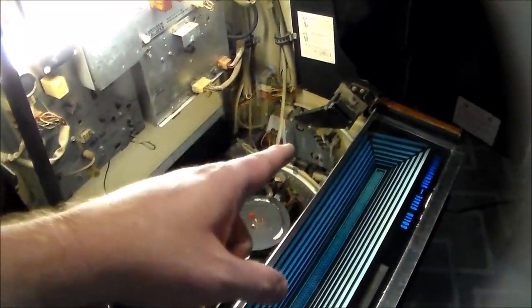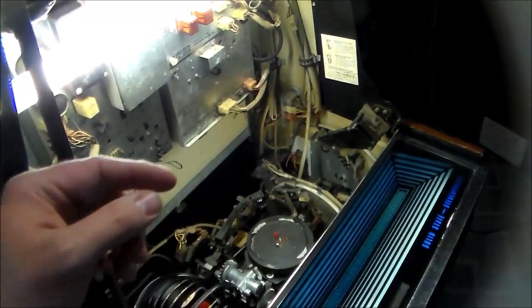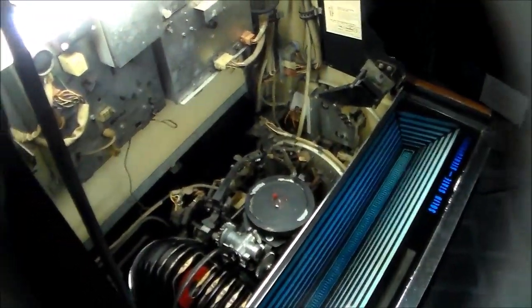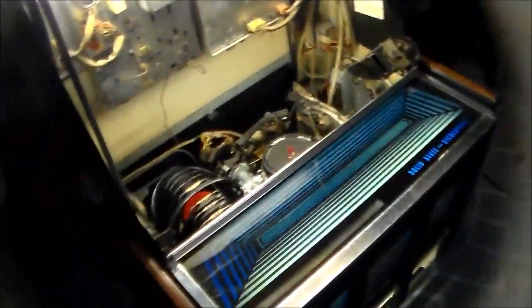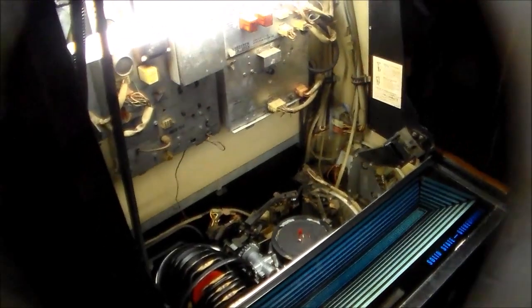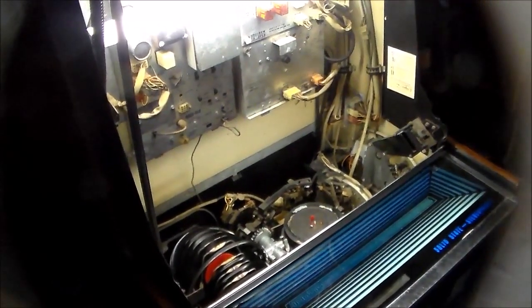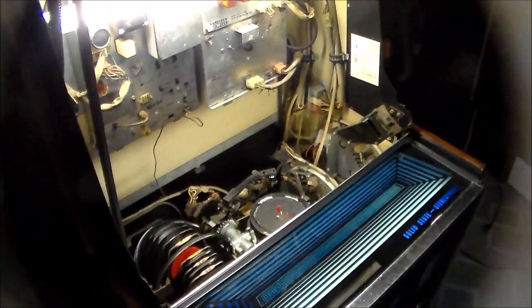So there are really three options: leave the coin mech in it, set it on free play like this one has been done, or add a button to the coin mech contacts on the exterior of the machine to add a credit. Homeowners aren't usually happy with the button option, so they prefer the free-play setup. The worst case is the solenoid goes bad and needs replacing, but if you don't leave it on every hour of every day you're probably going to be fine. We're going to leave it as-is — leave your comments below, give us a thumbs up, and we'll see you on the next video.